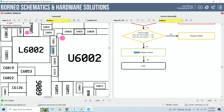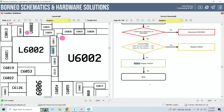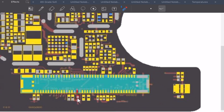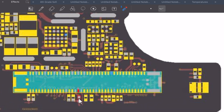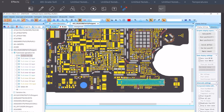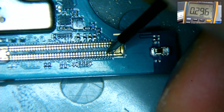The final step in the manual says to replace the display module, which has already been done by the customer several times. So we're going to use another software diagram to research other possible solutions. This diagram shows us the connector and how many pins are grounded — we count them individually and come up with a total of 12 grounded pins. We place our multimeter on diode mode to check if we come up with the same amount.